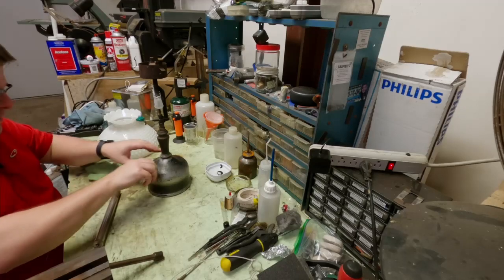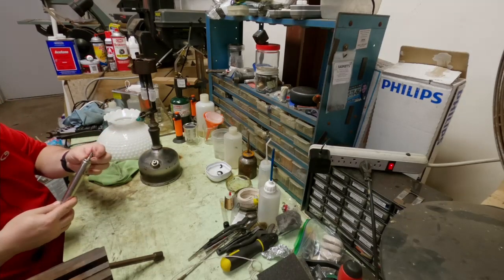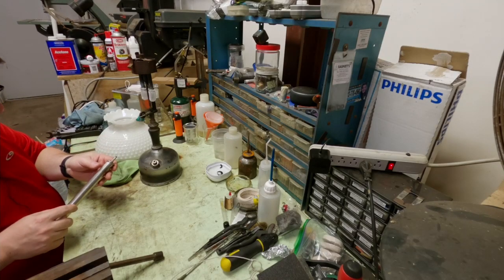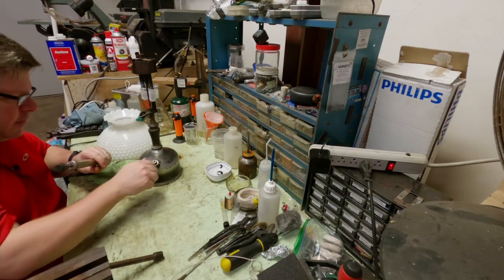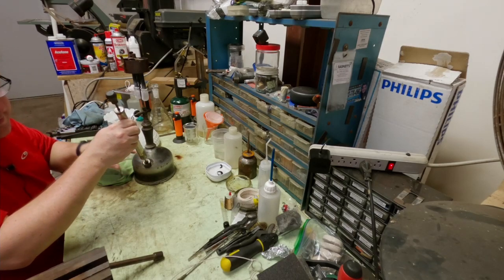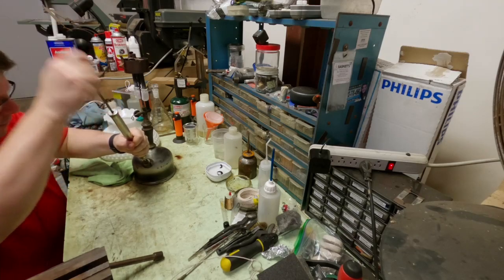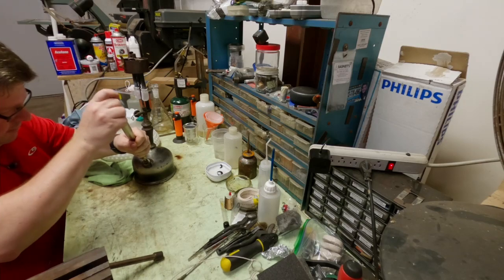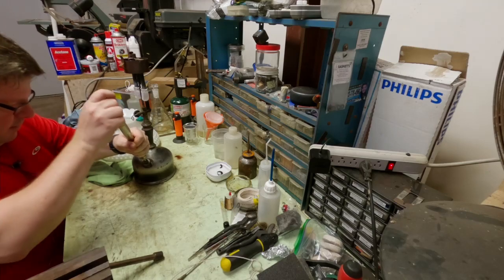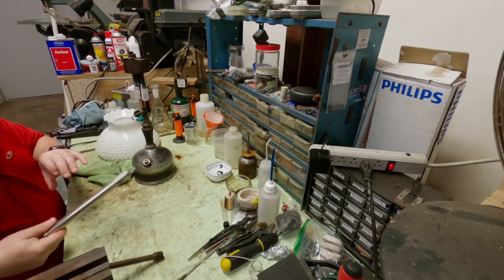This is your pump and that's how you pump the lantern up. It's got a very nice long stroke so it doesn't take a whole lot to get the air in there. The way it works is basically metal on metal. This isn't really the ideal type to use in here, but it does work — normally you have a little rounded bump on the end; the one I got looks like it was used for inflating basketballs. You just open the check valve inside the cap — they take the same gaskets as other caps, all replaceable with modern parts — and then you start driving air into it.